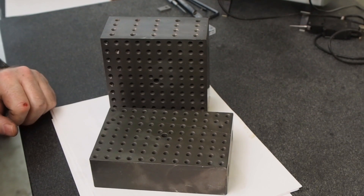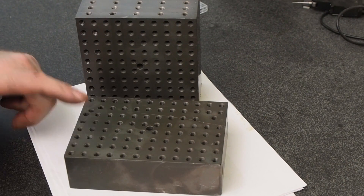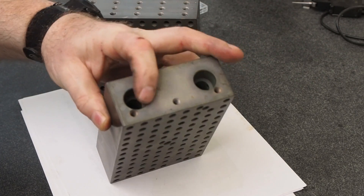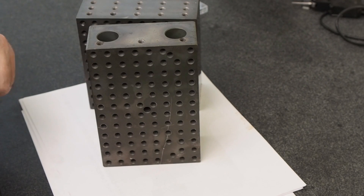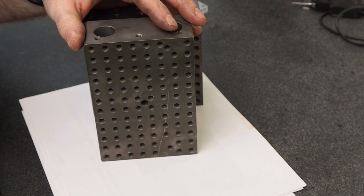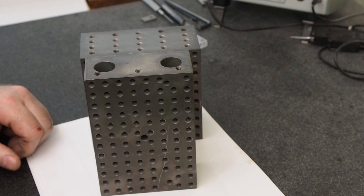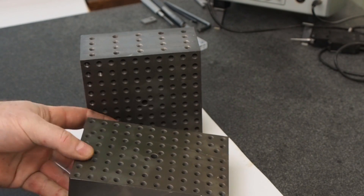When I was training my son Michael, he did most of the machine work on this. As I was training him we used this bit, and we also got this so that I can bolt this down to the mill table. We got clearance for a half-inch socket head cap screws over there, and then I got a hole pattern set so that when we do our multi-axis adjusting tool — it's a project you can back way up and see a video on, we'll probably put a link to that — it's a tool that we got a patent pending on, used for wire EDM work for adjusting a part in three different axes. It works real sweet, and so we got to actually get back on track and start building those as well.